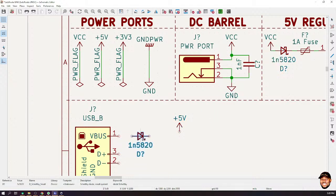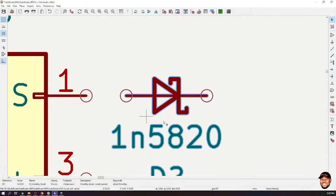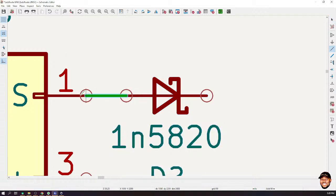And again, we need a Schottky diode, because if you use any regular PN junction diode, the normal ones, they have a forward voltage drop of about 0.7, right? So that means your incoming 5 volt will end up as 4.3 volt, which is not ideal. However, we know that this Schottky diode should do about 0.3. So even if we have an output of 4.7, it is quite manageable. Is that okay? In fact, even if you could settle for a diode with a better forward voltage drop than this, I think it will be superb. That would be ideal. But for now, let's just say we are stuck with the Schottky diode.